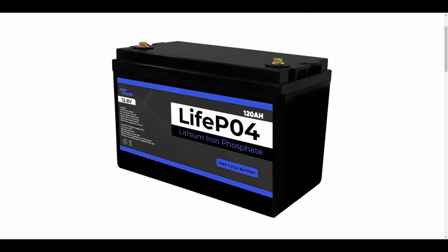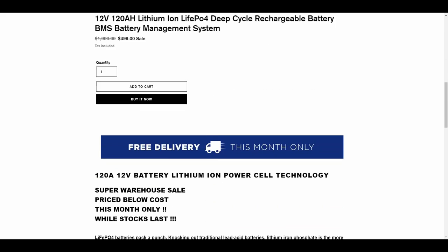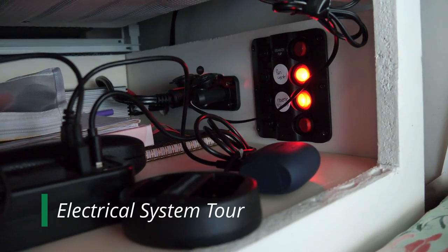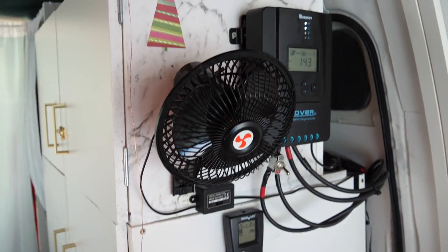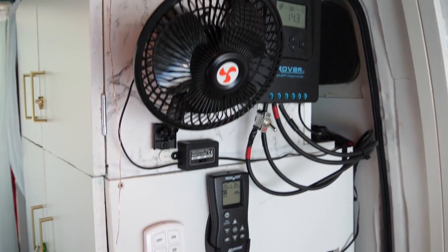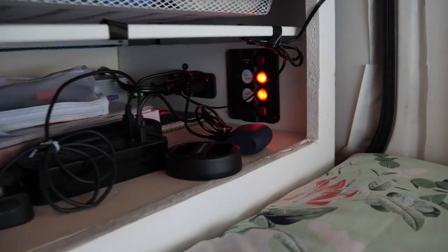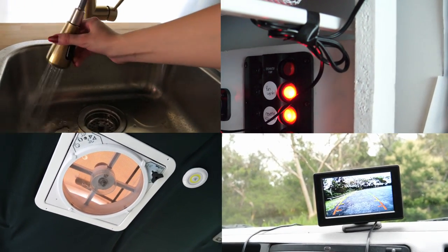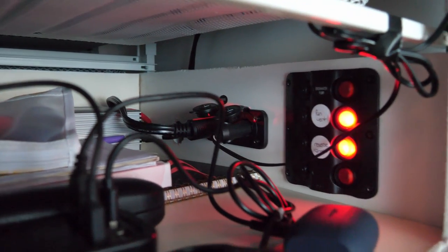My battery is from a website called 12V LiFePO4, and it is a 120Ah lithium battery. If you've been doing a bit of research, you've probably come across the differences between AGM and lithium batteries. Lithium is more expensive up front, but you can drain it to about 10% of its capacity, as opposed to AGM, which you can only drain to 50%. I've got my charge controller and my 12V fan on the side of my wardrobe, as well as the remote for my MaxxAir fan and my puck lighting. Then in my electronics nook, I've got the fuse box that connects to my water pump, my fan and my reversing camera, and the 12V outlets that have my fridge and the 12V fan coming off them.